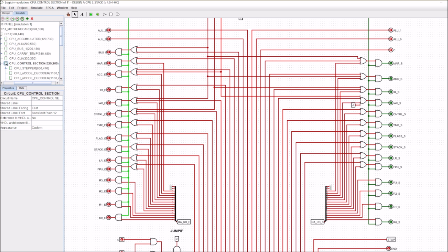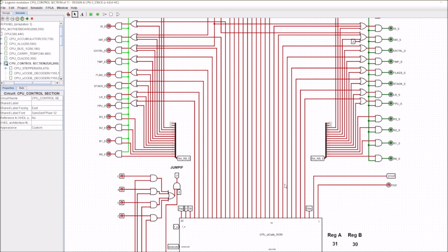So it means in effect you can think about this as we've got control over all the sets and the enables from the microcoded control unit, which we need because the microcoded control unit is clocked, and as the clock changes, all the sets and the enables change. So for example, if we were doing a data command, it's going to have 4 different lines, and on each of those lines different enable and set lines go high.